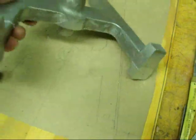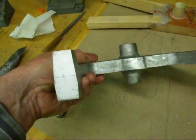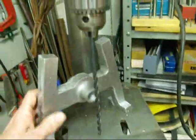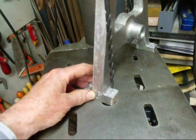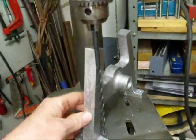It is very difficult to drill from the bottom side, which would be the more logical way to do it, but there is no way to hold it and I don't want to do it freehand — there is no good way. So I am going to drill it on the drill press with one of the big long drill bits that I showed you one time, and that is going to work quite nicely. It is a quarter inch bit and we will just go all the way through — we have plenty of clearance and we are not going to hit anything.